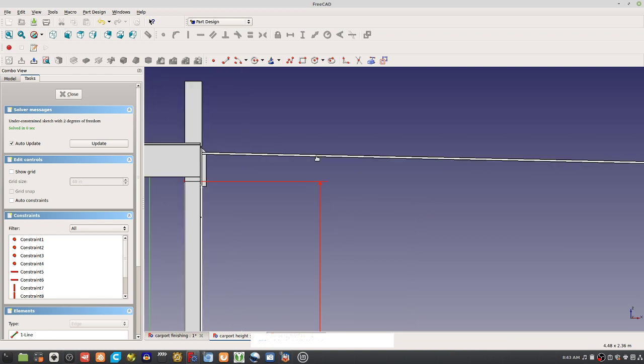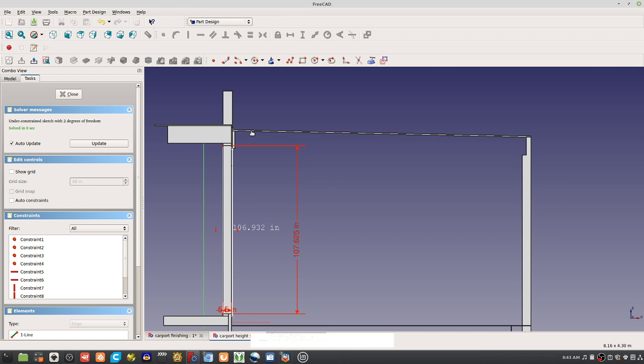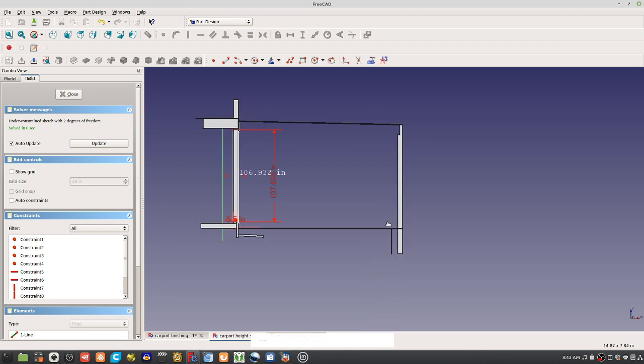which I slanted by, remember the number 1.2 degrees? Yeah, I slanted it 1.2 degrees for a 4-inch rise against 16 feet, and then you've got this post on the other side, and that's basically what the shape was. So from there, the frost line here is 30 inches, so this is sunk 30 inches.